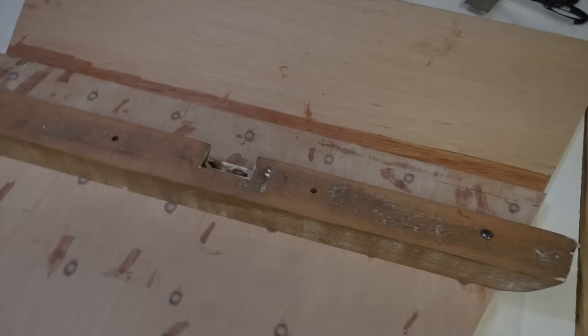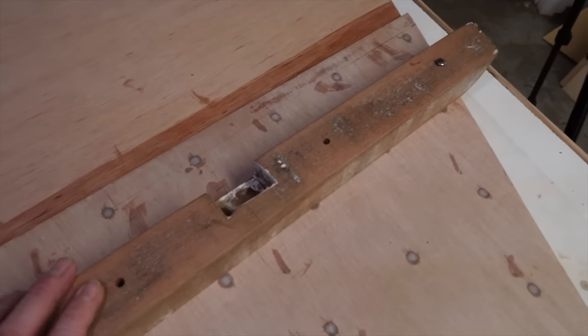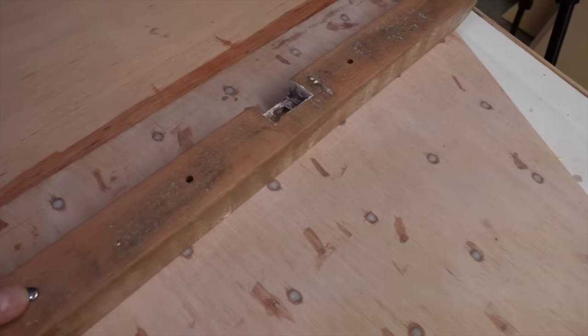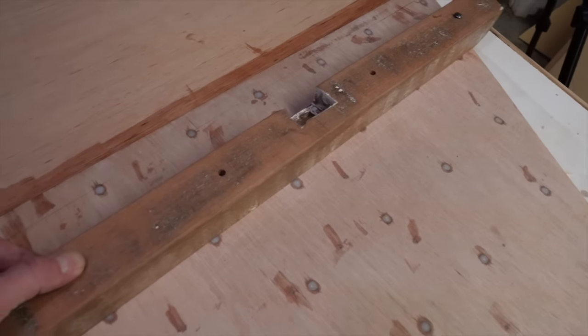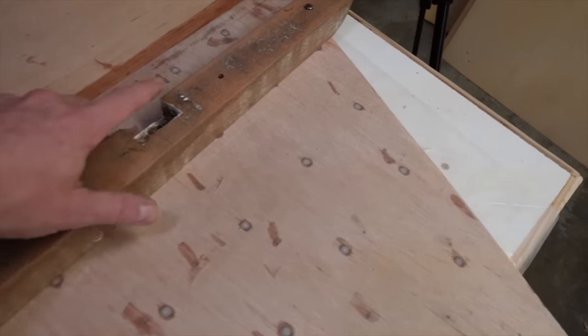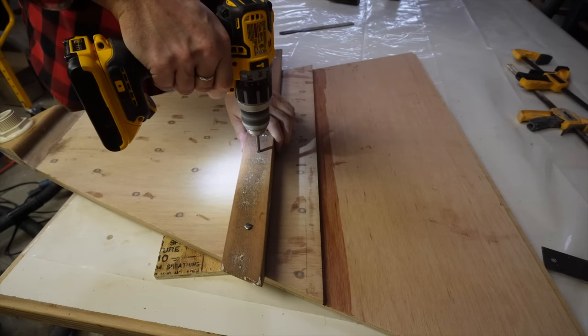I really love setting things up to drill out this way because you get a really good through bolt. By using the drill press to drill out the four holes and then mounting the two smaller ones on the outside, and now we've got the epoxy plugs on these two holes, we have a really good drill jig built in. So we'll run the drill bit through this.